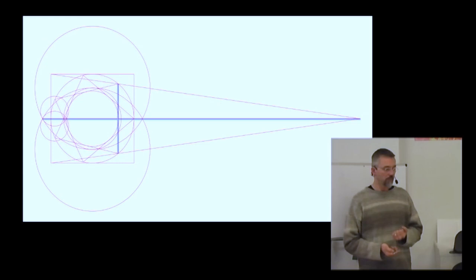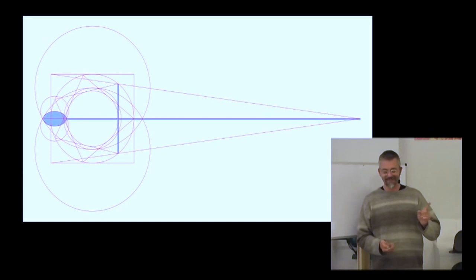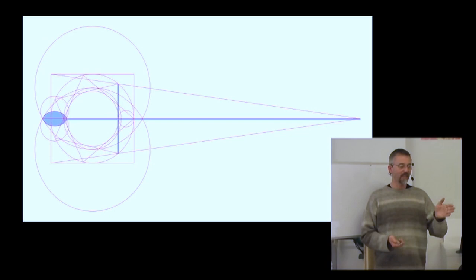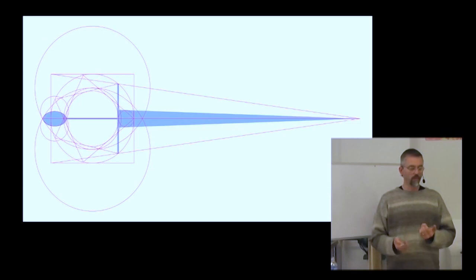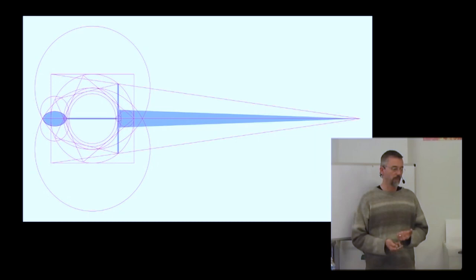I do that. No, sorry. This is the width of the blade that is defined by the distance between the guard and the edge of the square. That gives us a basic feeling for the dimension or proportion of the blade. And by projecting the outer circle via the mid of the cross guard, we get the thickness of the guard. So now it's possible to do a complete design of this sword based on these proportions.